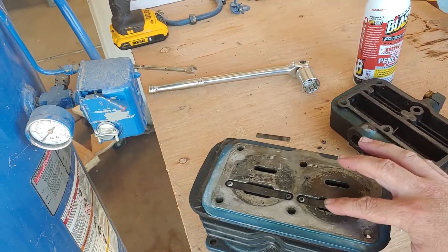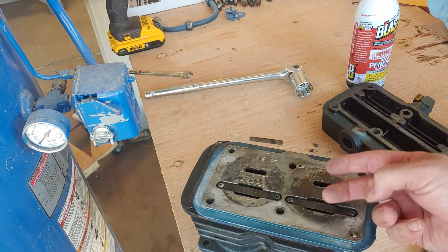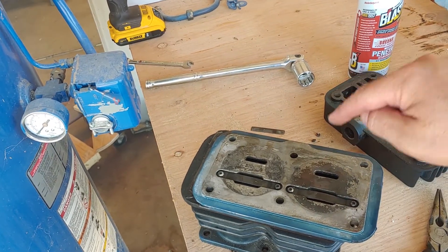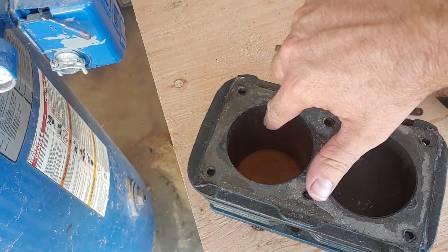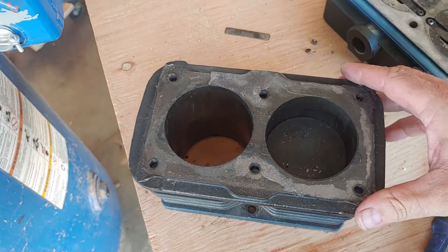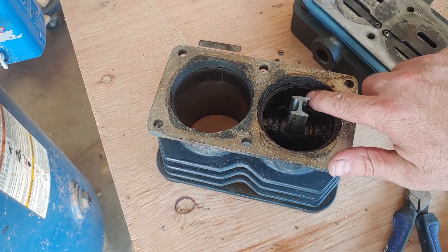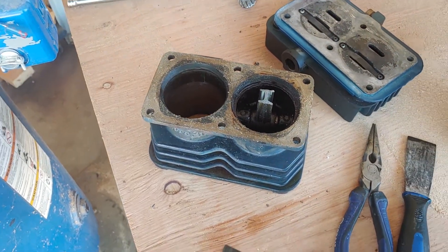You can see this is where the top of the cylinders are going to be — they'll draw air in on one side and then push it back out on the other. Because these reeds are on opposite sides, that's why that works. As the air is coming in, one reed is going to be sucked down and sealed off, and this one is going to open up — the air will get pulled in here and pushed out here. Here are the pistons. This is just a round opening in this piece of cast iron — that's the cylinder. The connecting rods connect here onto that cylinder. This broke when I was trying to get it apart because this piston has some corrosion in there and it's jammed in completely tight, locked up — so that's why this one failed.